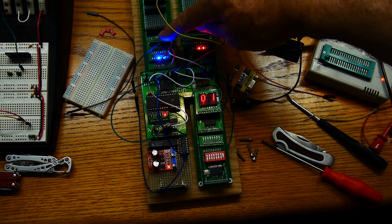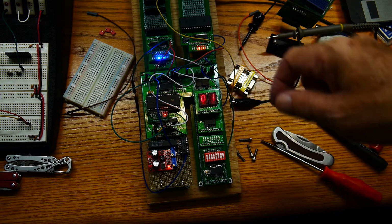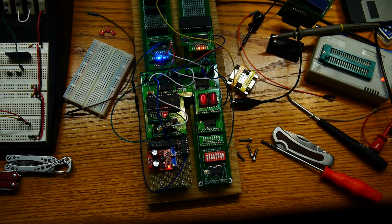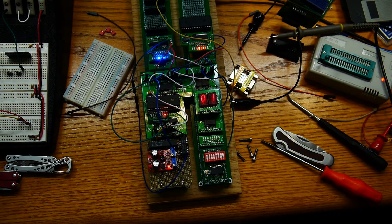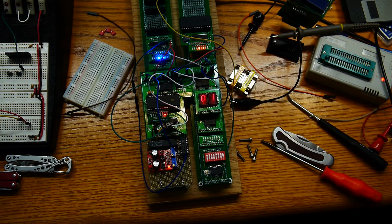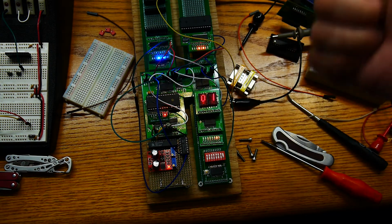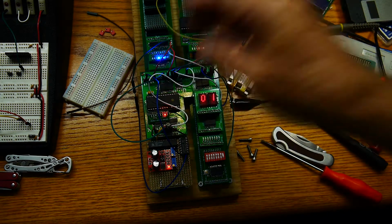These counter chips, these 163 chips, are synchronous chips, which means you have to assert the clear pin and then pulse the clock. And I'm not pulsing the clock. The only time I'm pulsing the clock is when I do a PC increment. Well, I can't do a PC increment and a clear at the same time with the hardware that I have, so that's not going to work. And that's also why the number 3 instruction didn't work, because it was a synchronous load. I loaded the value onto the bus, but then the clock has to be asserted. So you have to pull down write and have a clock go for it to load the data.